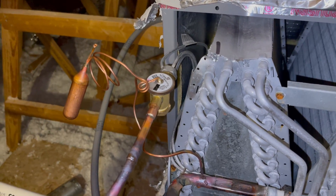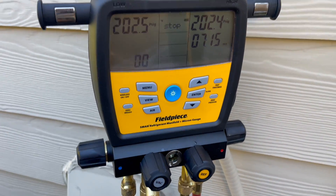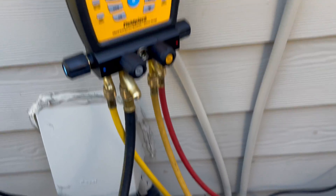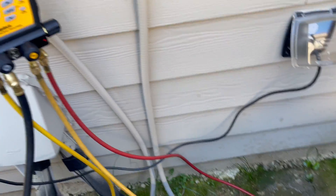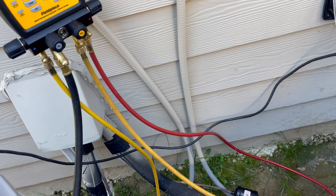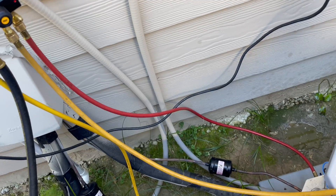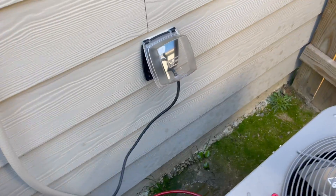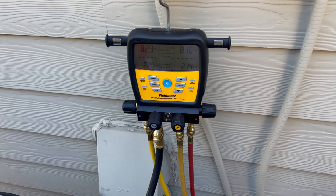So what I'll do now is just pressurize and make sure we don't have any leaks up here. We know we're leak free up at the valve where we just installed everything. But I forgot to replace the filter dryer. So at least we know we're leak free. We're going to do the whole process over again — cut this out, put our new filter dryer in, and then we'll purge and flow nitrogen as we braze this. Got our new dryer installed, just making sure it wasn't leaking — it all looks good. So we're going to remove the nitrogen out of the system and start our vacuum, then go upstairs and finish putting the evaporator back together.